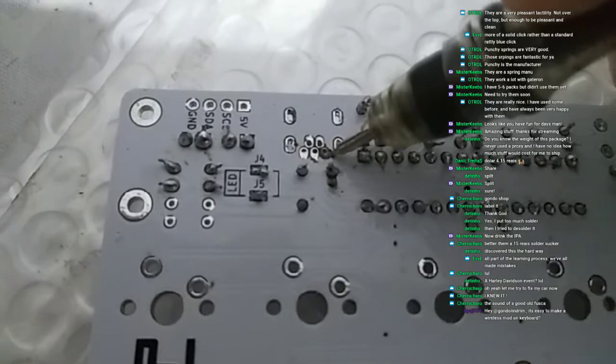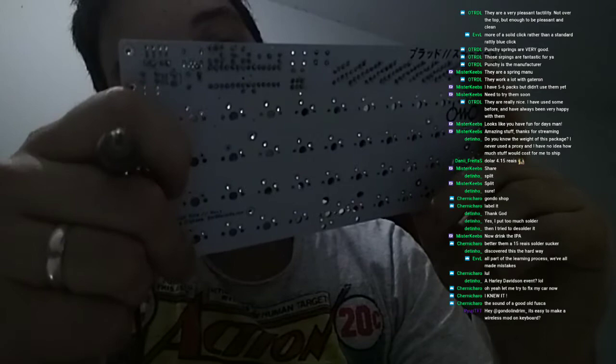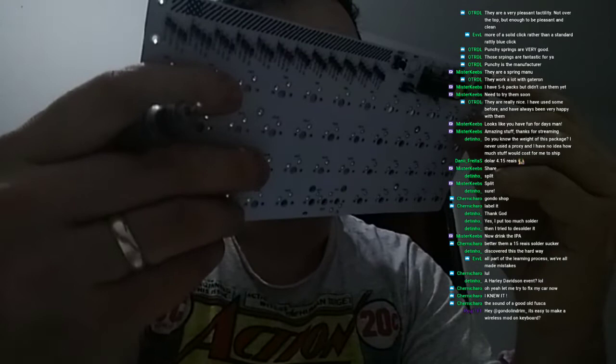On the other side, everything looks... I mean, on the other side there also is a busted pad, which is this one here. But this one, if I remember correctly, this middle pad is the ID pad. I really don't remember. No, it's not. It does have a trace to it. Yeah, so I really am not sure anymore if we can fix this, because we need to find where every pad should go, and we will probably need to make those jumpers now.